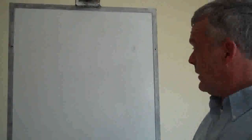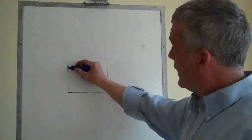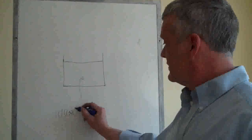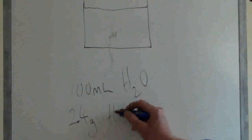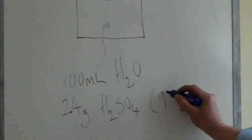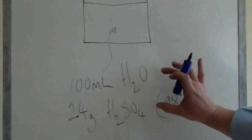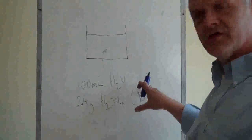To set this up, you need an electrochemical cell — really quite a simple thing, just a container with some liquid in it. That liquid is an ionic liquid, meaning it will conduct a current. This particular one is made up from 100 millilitres of water and 2.4 grams of concentrated sulfuric acid at 98% concentration. That makes your base solution, and the experiment would work with this, but the graphene you flake off would be quite thick.